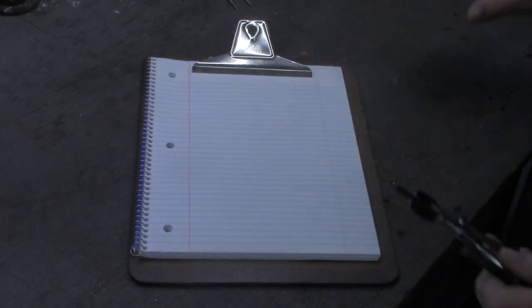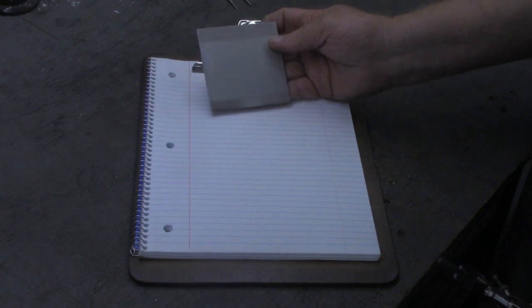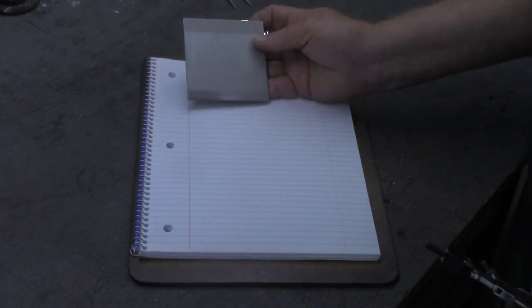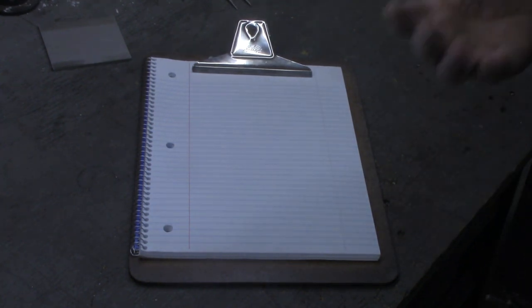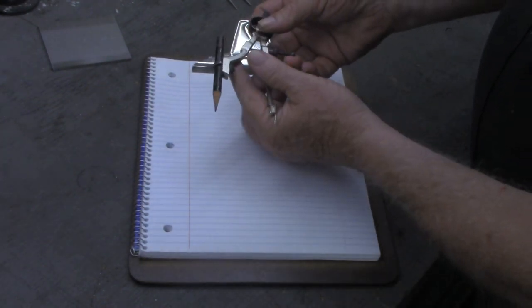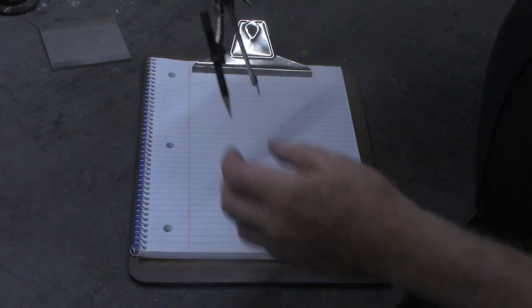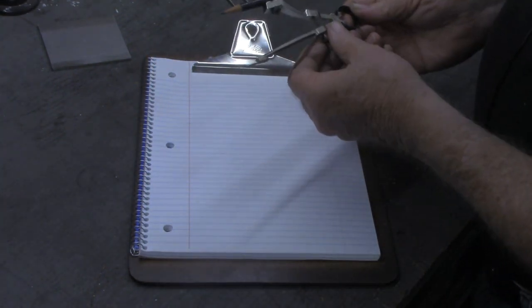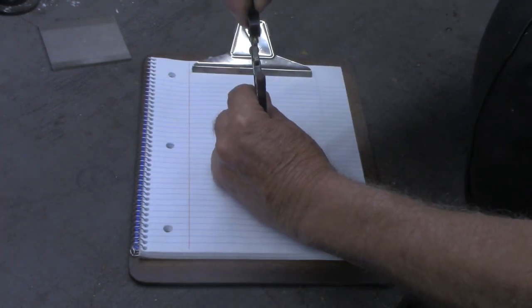When I say I'm speculating, I'm going to show you a scientific way of laying this out — finding the dimensions required with exact measurements using trigonometry. But without that, let me show how it might be done without any trigonometry. First, I'm going to take my high school geometry class compass here and draw an arbitrary circle. I have no idea what this diameter is — I'm just drawing an arbitrary circle.